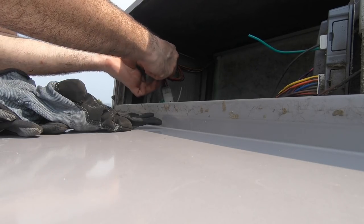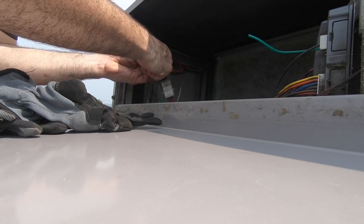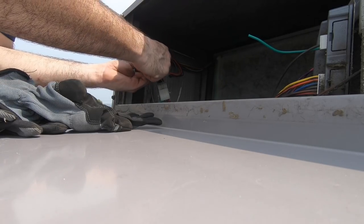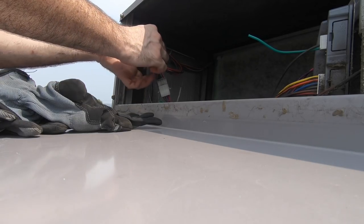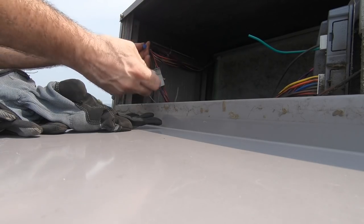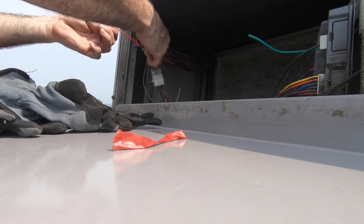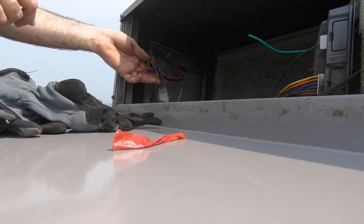Nothing else holding this unit up. So it could be a bad economizer controller not sending me 24 to my contactor, because it wants me in free cool. Free cool in a computer room. That's really not going to work. Okay, jump.